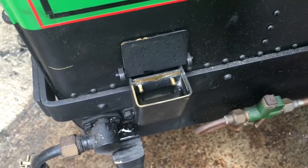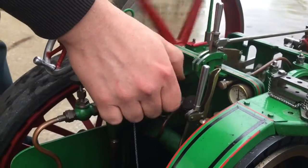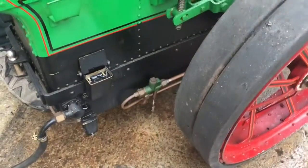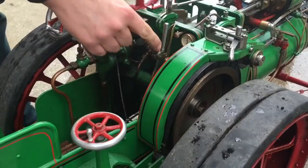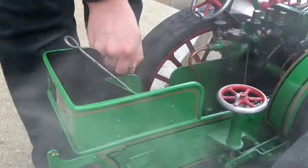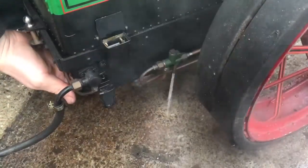When it overflows, I'll show you what John does to turn it off — that left-hand one at the top. Next is the injector. The injector is the water valve on that side; turn that on first and out of the injector will start to dribble water. Then you turn the steam valve, which is the second one on that one there, and it will go. It spits a little bit, so you can knock that water valve back a little bit until you get it to pick up cleanly.